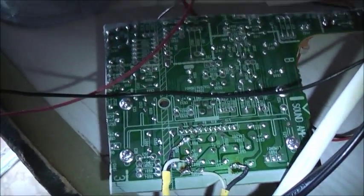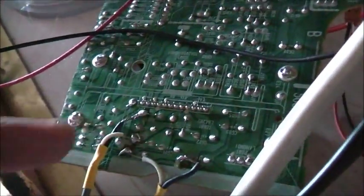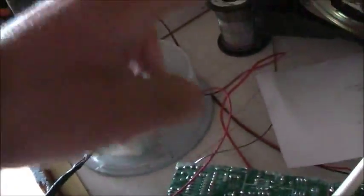So I might have to put the positive straight to pin 5 to get it to pick up the signal properly on the right channel. I just tried that — disconnected this, put the positive of the right channel input and tapped it directly at pin 5 — and it worked, but I'm getting the signal through both channels. So because of how the circuit board is laid out, the little components are joining the signal together on the left and the right — I'm getting both channels mixed together.